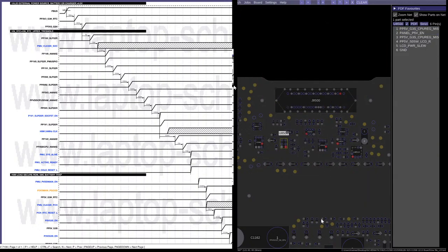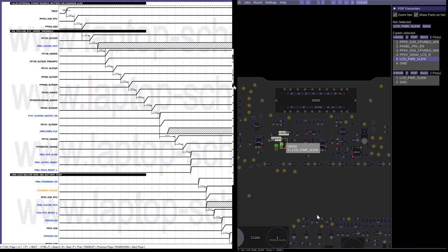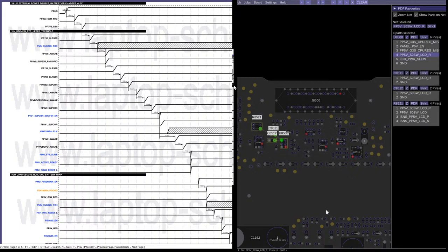Now this chip here keeps getting warm whenever you see this. You just power up the board and you'll have this chip getting hot. But this is a red herring. This is throwing you off from what's actually going on, because we've tried replacing this chip and it didn't do anything. The board still stayed dead. The new chip got hot the same way.